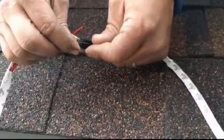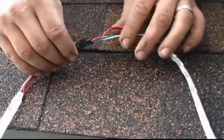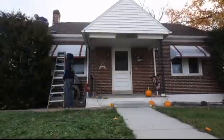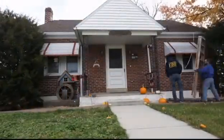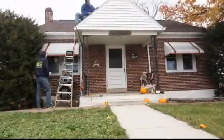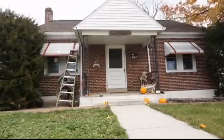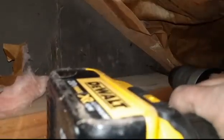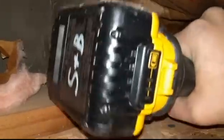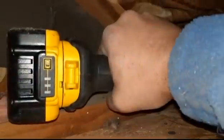Here are the connectors that the flexible strips I purchased came with. The black and red wire is for tying in auxiliary power when you need additional power — in my case I did need additional power. Here you see the time lapse of us putting the strings on. The LED strips need additional 5-volt power taps in the middle of the string in order to supply enough 5-volt power throughout, due to voltage drop across the LED strips and the wiring.